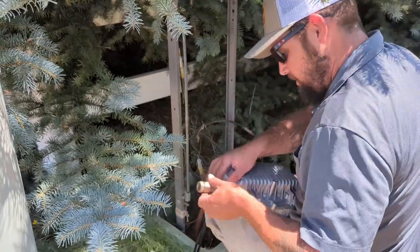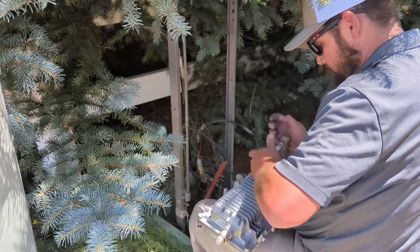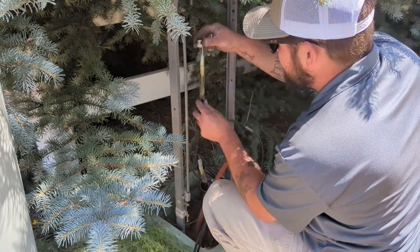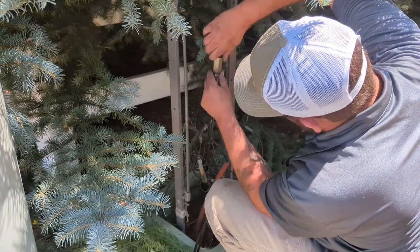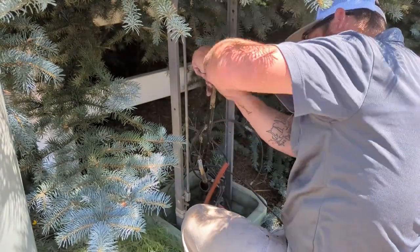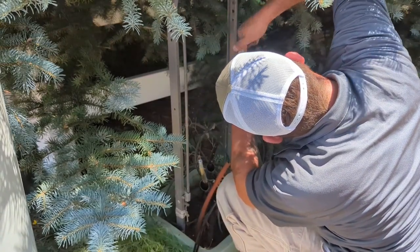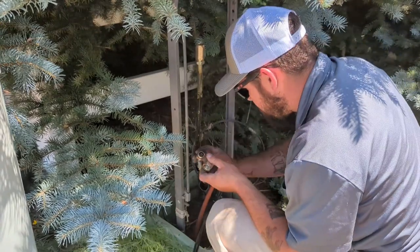Here's our line extender that we just built. We're going to take the back sides off of these fittings — these are three-piece fittings, we're going to take the two back pieces off. Doesn't matter if we mix and match them. Back piece goes on first, then our other one — they line up pretty good so we're not going to have to re-core this stuff. It doesn't look burnt or bad. Don't want to cross-thread these because if you do you've got to go find another one in the truck.